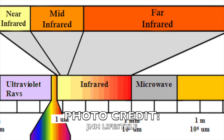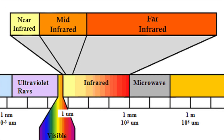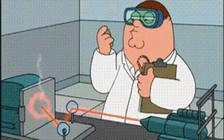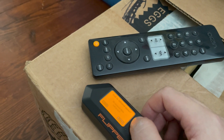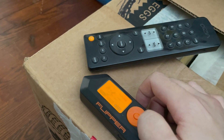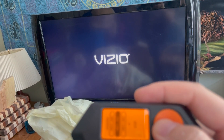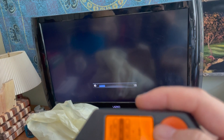The third system of the Flipper is the Infrared Receiver and Blaster. This should be the most friendly section for tech muggles — you don't need to understand any technology to use a TV remote. Infrared is a type of low-energy electromagnetic wave just beyond the visible spectrum. It's an inexpensive and simple tech that we widely use in TV, audio, and air conditioning system remotes. The Flipper can read and emulate infrared signals, basically allowing you to use it as a universal remote.